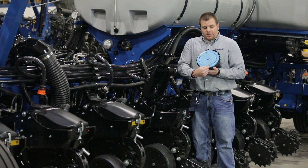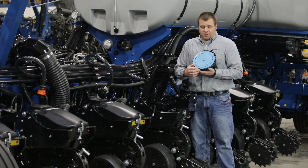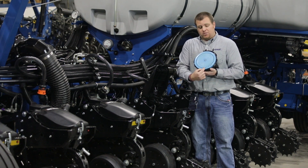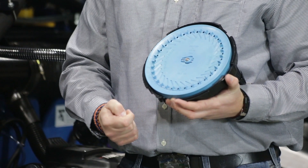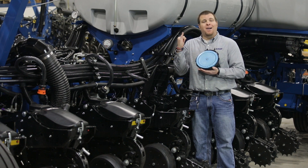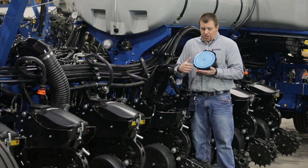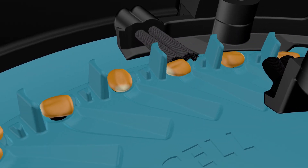If you look close, in front of the pocket you can see really two stair steps in front of the seed. The nice part about those stair steps is it helps if there was a double in these locations. So if there were two seeds in between these two walls or paddles, those stair steps help keep the seed up and really on a pedestal kind of all by itself, which makes it a lot easier for our singulator brush to come around and knock off those doubles. So really a lot of technology built into the design itself to help with singulation.